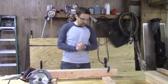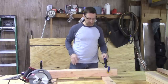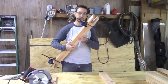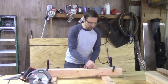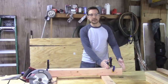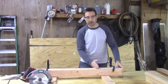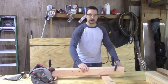Now we need to make the notch for the side rails, which is really easily done. We're going to clamp both boards back to back — they'll be on opposite sides of the bed. We measure up and make our notch for the 2x4: one and a half inches deep by three and a half inches high. We're going to start it eight inches up from the bottom, which we believe is a good height to fit things under the bed — then up another three and a half inches. Same cuts with the circular saw as before.